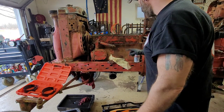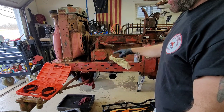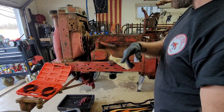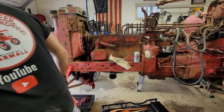Okay. Number two, wipe the cylinders out. Make sure all the gook's out of them. And then we're going to go underneath, clean out the crank journals, go through all the holes for the oil passages. We're going to clean all those out, make sure everything's good. Make sure nothing's sitting on top of the crank where the mains are. And then once we do that, we're going to start positioning these pistons in there.